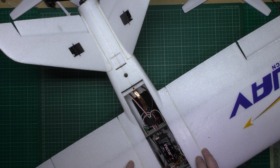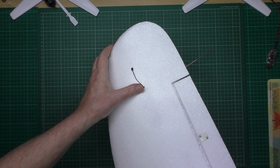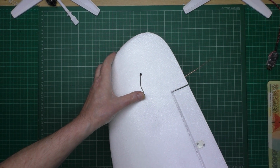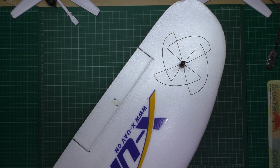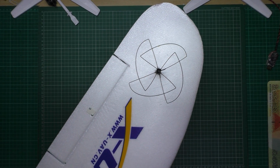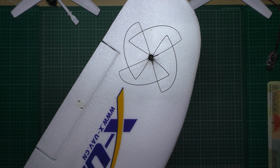So what I've decided to do, the other thing as well, the Easy UHF that I'm using is in the wing, and a lot of people have said, I don't know why you put it in the wing, because it affects the balance, you know, the lateral balance. And also with these antennas that I got from Simon, I can't fault them, but having it out on the wing causes a lot of drag. So I've noticed that when you open the throttle, it actually pulls to the left. I didn't think that thing would affect it, but it does.